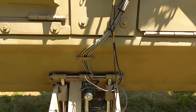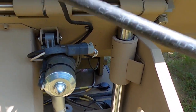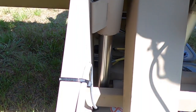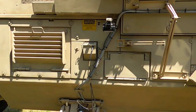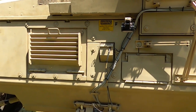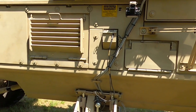Procedure 4. Check for missing or damaged guide supports or guide tubes. Clean guide tubes with detergent and water. Equipment not ready or available if missing or damaged guide supports or guide tubes. Lock pins are installed through support arms and clevises, then rotated to lock in place.